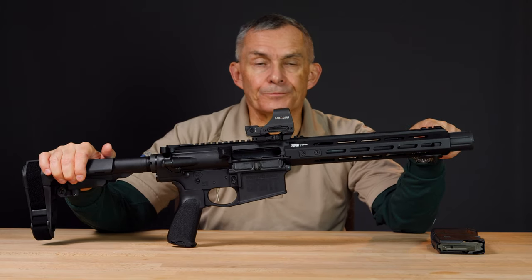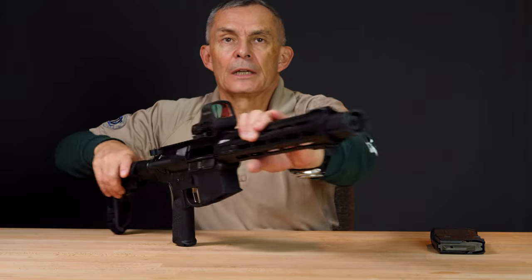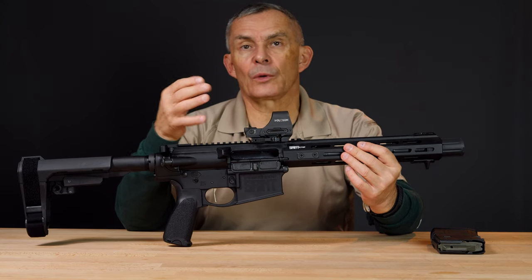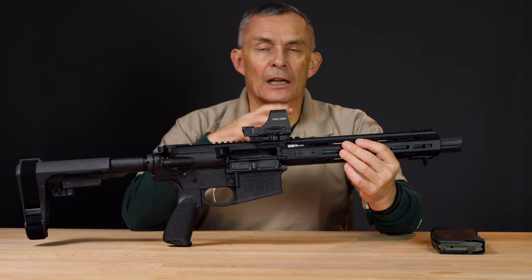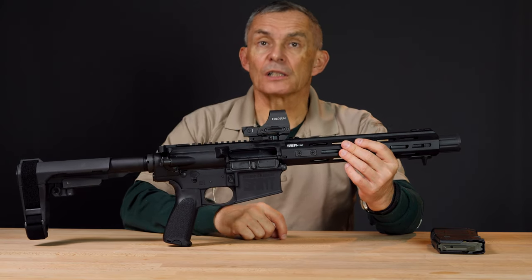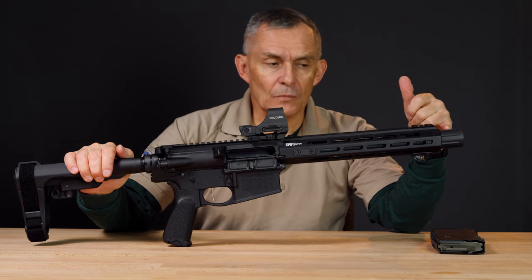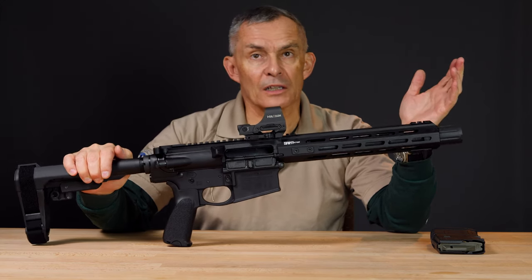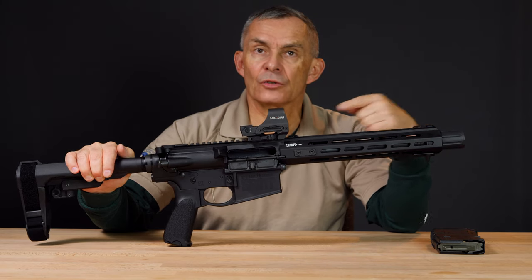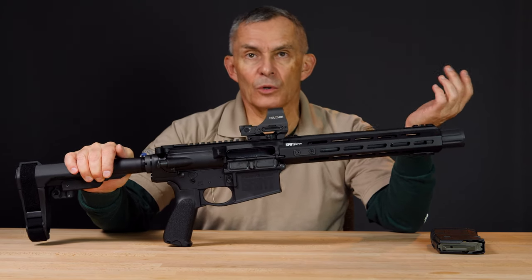This blast diverter is a two-piece blast diverter. If you can see it toward the camera — it pushes the report forward away from the gun. If you stand close you can feel a little concussion off the round, but the diverter does exactly what its name says. Because this thing is so short and it's a direct gas impingement AR — not piston driven — the gas port, the diverter, all of it is calibrated to make sure the gun runs reliably. We put about 40 rounds through it and didn't have any trouble using just military spec ball ammo — worked just fine.